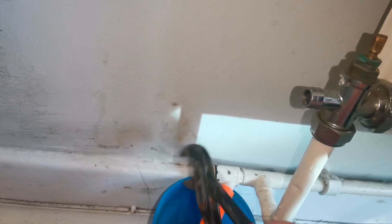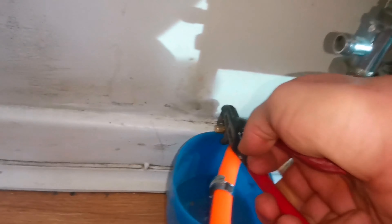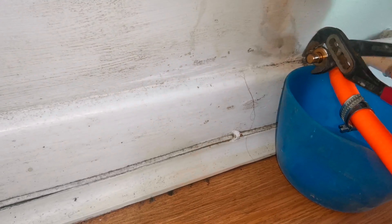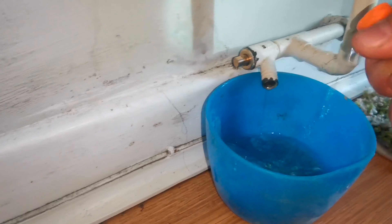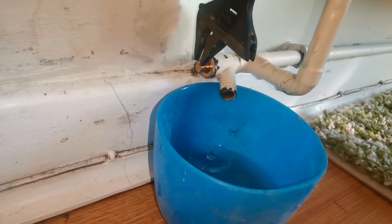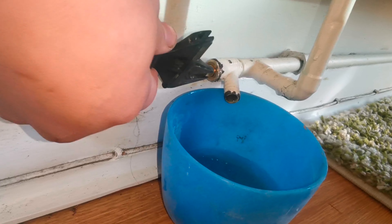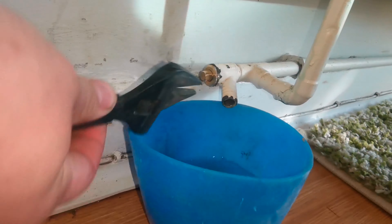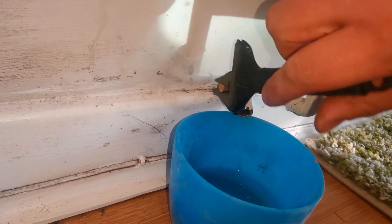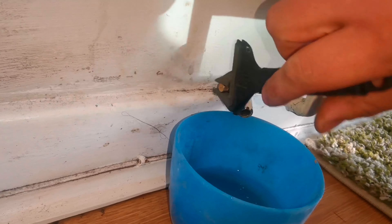I'm slowly taking it out — I know water might come out but I'm ready to put it back if it does. There are two parts to screw: the outer and then the inner. I've had a look and I can see there's a bit of the washer missing — it's perished. I put a screwdriver in there just to clean the seating, then screw in the first bit of the drain cock, then the outer, and tighten up the outer before re-tightening the inner.